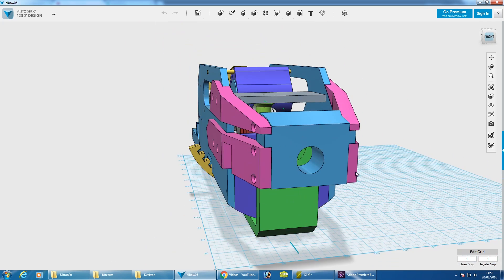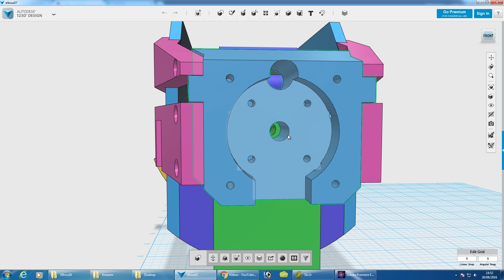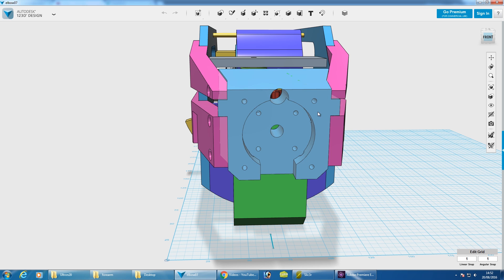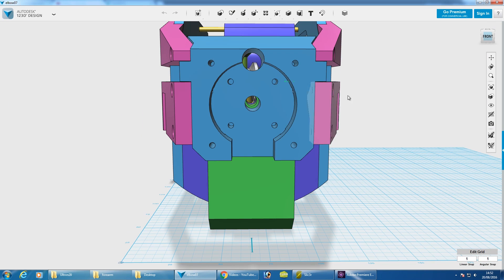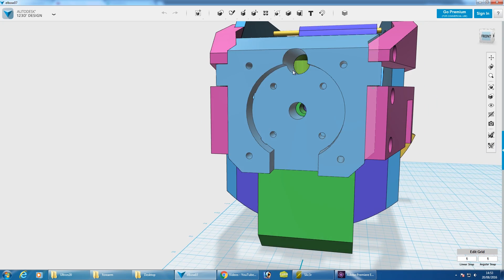I started to work on a block on the front to build the actual wrist rotation on — and we need to not forget it's pulled by the pulley right inside. Here's the final cutout for the front. I've got a main pivot that will take a piece of 8mm studding and another recess with screw holes on the inside and outside, to allow a thing that's anchored and a thing it rotates against. I've left a cavity for wires so we can put some force sensitive resistors in there — I'm not going to design that yet but I've left space for it. I've also left a hole in the top with direct line of sight to the pulley so we can get the string there to pull the hand.